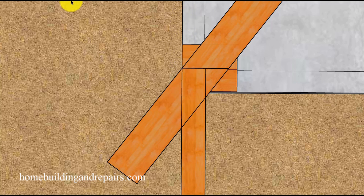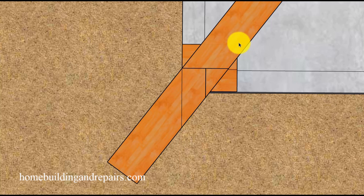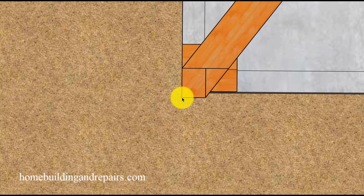That can be done by putting a 2x4 on top of the rafter and drawing lines, or by using a framing square off of this line and then measuring over to get the second line. Once you have these lines, draw a line where it intersects the bottom of the rafter to give a nice three and a half inch line to connect the bottom of the roof rafter to the top of a 2x4 framing plate.